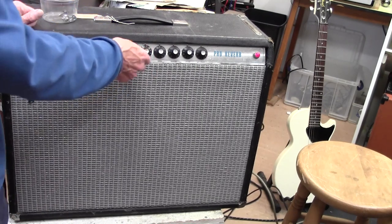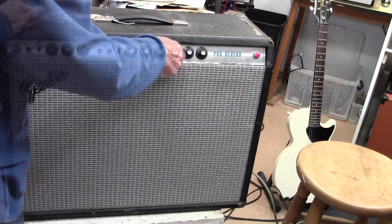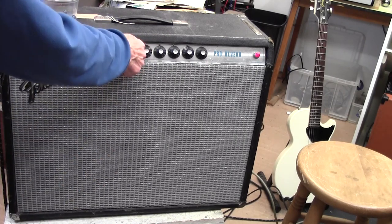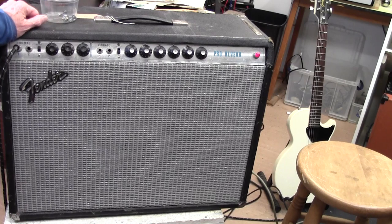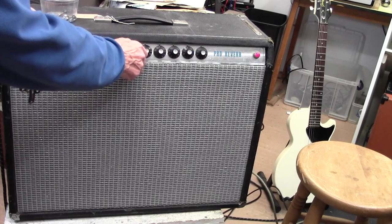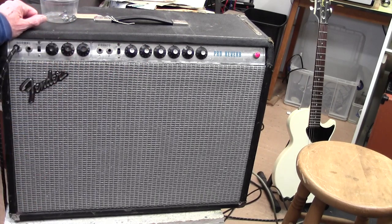Also, the controls are quite dirty. Certainly crackling and spitting. Now, I know what you're thinking. Valves. But you'd be wrong in this instance, because I have already gone through and swapped out all the preamp valves, so it's not a valve-related problem, it's going to be some sort of resistor or capacitor. So I think we're going to have to take the chassis out of this one, get it up on the bench, and see if we can track this fault down.